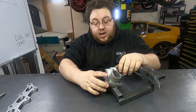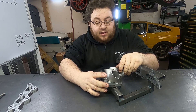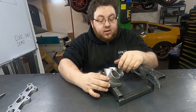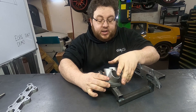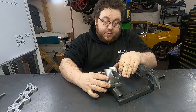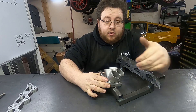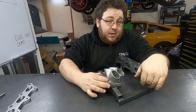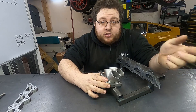We can move it side to side. So what I tend to do is set it slightly back — maybe about 2mm from its standard position — and by the time I've welded my runners and we get a bit of shrinkage, we bolt it back in, slide it back down, bolt it back where it needs to be, and then we can just remove a bit of material on both sides of the runner until we get a perfect fit. And that's the way — it's the one way of dealing with shrinkage.